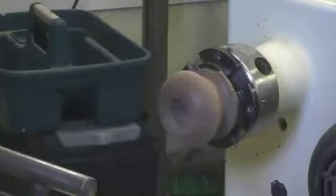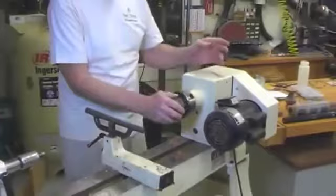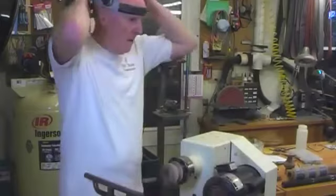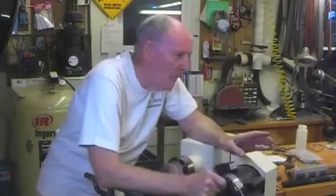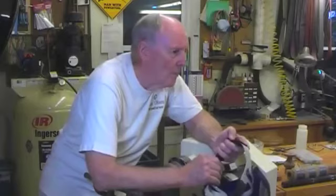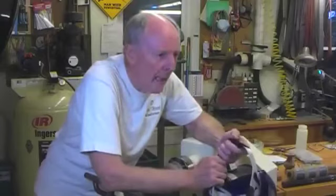that I think is enough. Does anybody have any questions about hollowing? Have you done hollow forms? What sort of system do you use? I like the Easy Wood tool that's got the crooks on it. A lot of the new ones, yeah. I haven't done a whole lot of hollowing lately, so I just stick with the old stuff, before all this carbide started coming out. And what do you do for wall thickness? It depends on what it is, of course. How do I measure it? With calipers. You like calipers? Yeah, I use calipers.